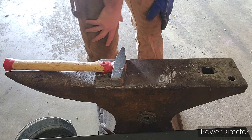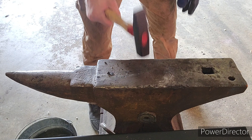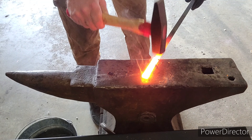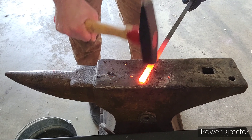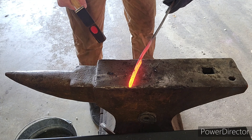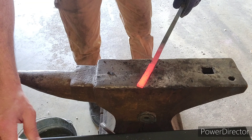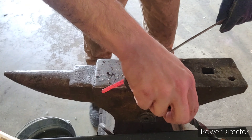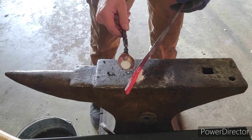Just for reference, I have my forge at 28 PSI — the hottest I've ever run it — and we'll see if that gets it up to where we need to be. I think we'll give it a try and see what happens. Maybe give that forge a little bit more power. Hopefully we can clean up and run this out with some more borax, but I don't know — I think we might be in trouble. We might try this again.